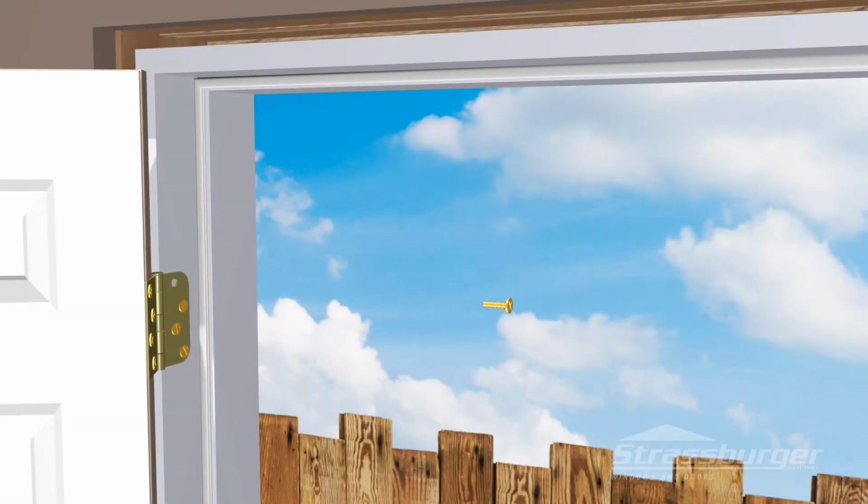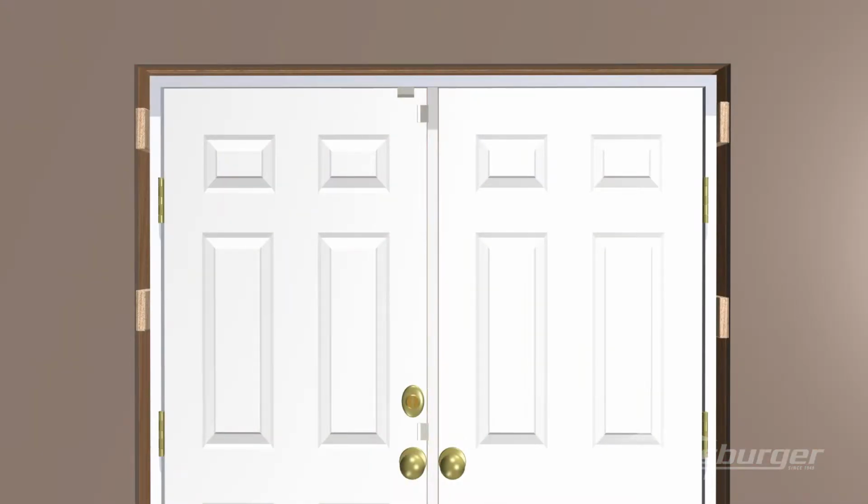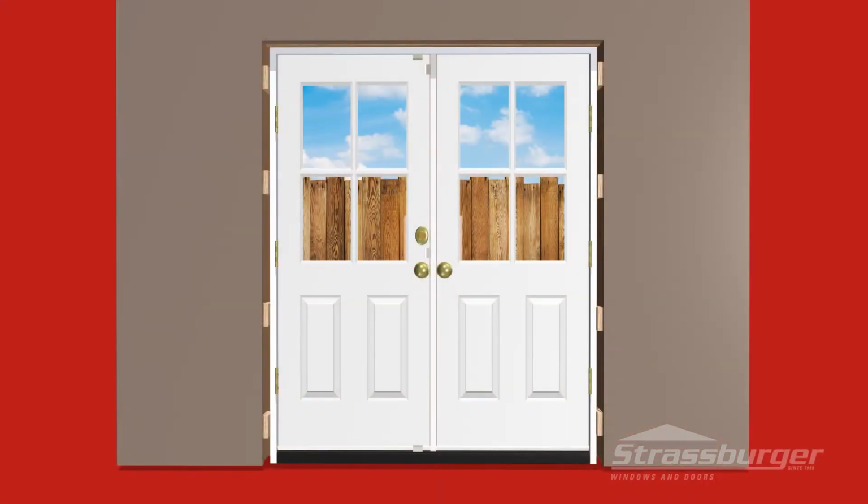The 5th and 6th screws are now installed into the top of the top hinges. Again, just make the screws snug, do not over-tighten. The purpose of no shims in the top hinges is to allow adjustment if the door slabs for some reason should sag towards the center. This can happen depending on the size and weight of the glass chosen for the doors.